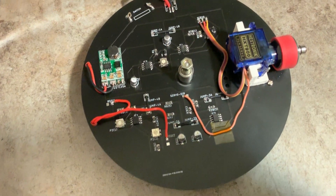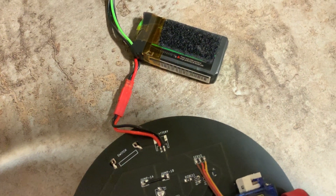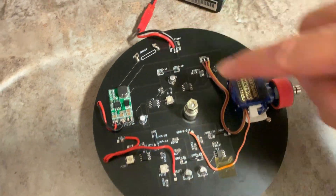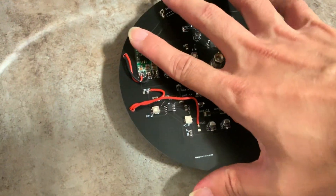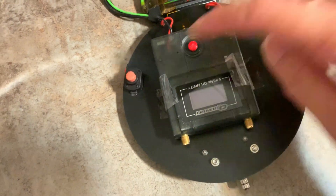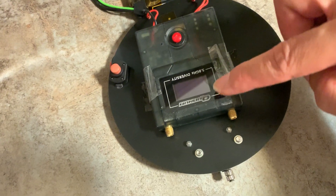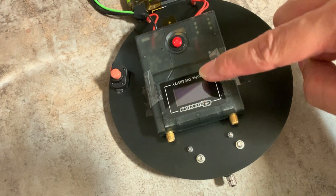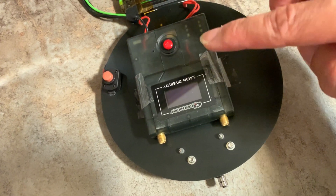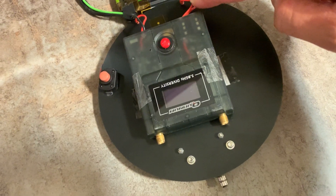The electrical components and wiring are now done on the tracker board. We have a 3S LiPo pack connected to the tracker board using a JST plug. The top view of the tracker board shows the power on switch and the Hobby King quantum 5.8GHz diversity receiver. You could use any 5.8GHz receiver that has two receiver modules inside to hook up the RSI wires.